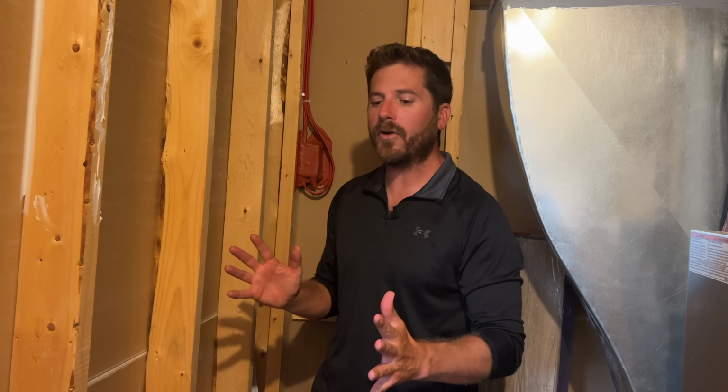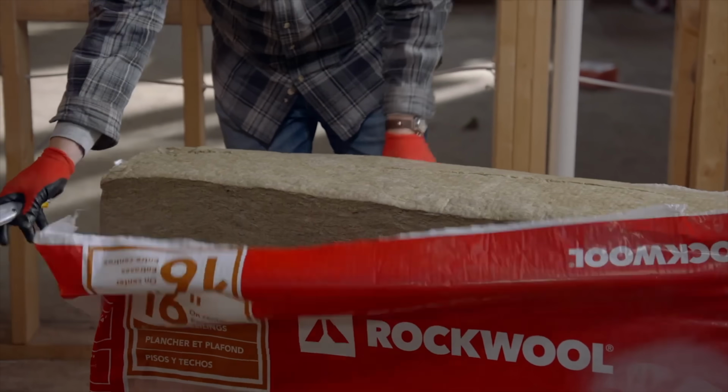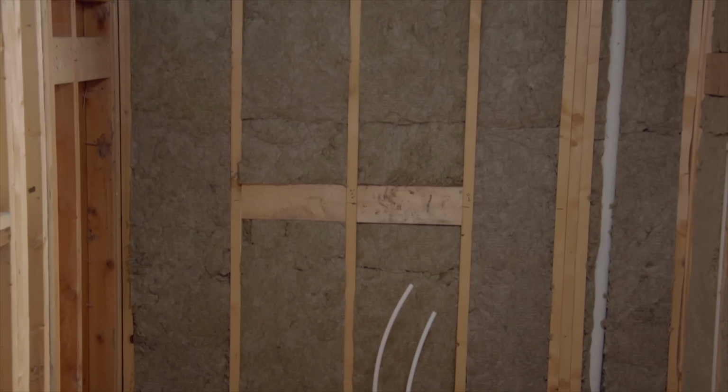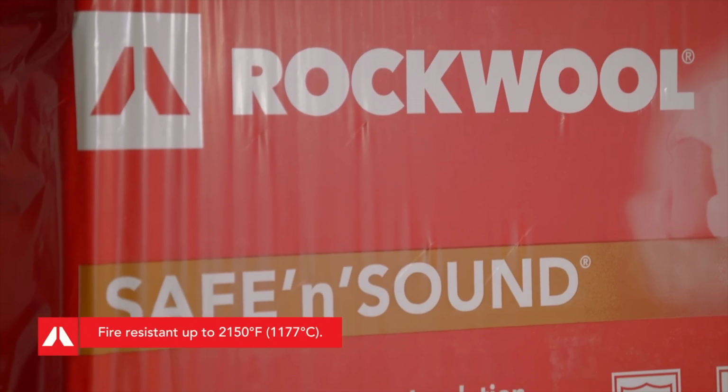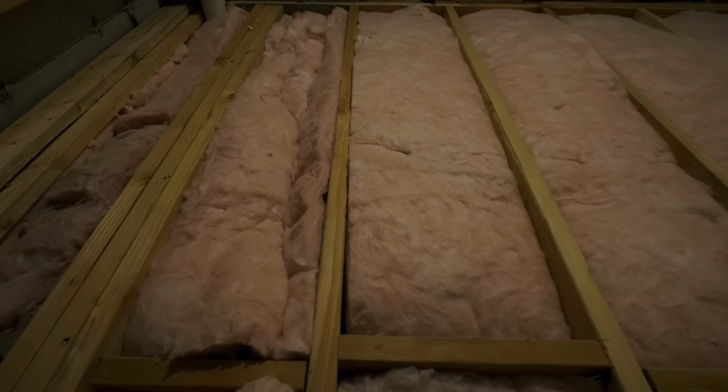Now, the first thing that you want to do before you even start building a second wall, you want to take care of this one. What you want to do is add some insulation. What I would recommend is acoustical insulation, something like Rockwool Safe and Sound. This video is not sponsored by them. But if you were to put insulation all throughout your house, I would probably just use the pink fiberglass insulation because it's a lot cheaper.